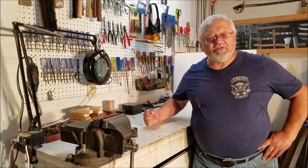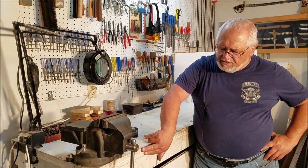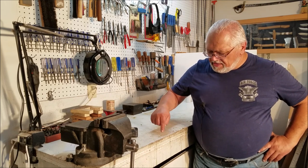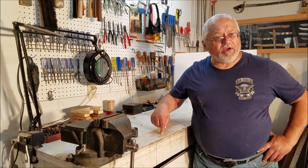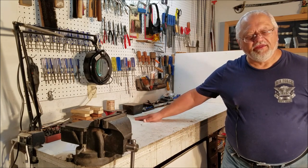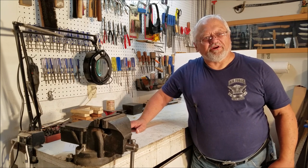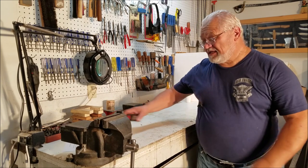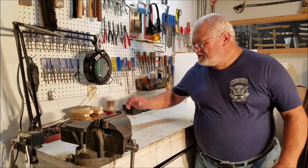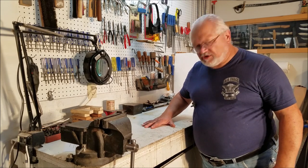You want the bench to be extremely solid and as immovable as possible — bolt it to the wall. I've got two sheets of three-quarter-inch plywood cut in half and laid on here, and then I put a white laminate on the top. Why a white laminate on a gunsmithing table? It doesn't stay white very long — it gets chipped up, but a coat of paint will cure that. The reason for a white top is it's real easy to find screws, pins, and clips and springs that go astray during disassembly. If you've got a dark top, it's a lot harder to find things. This bench is about 15 years old now, so it's got its battle scars.